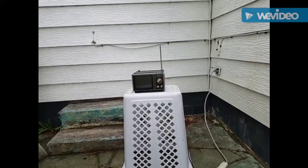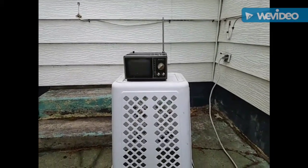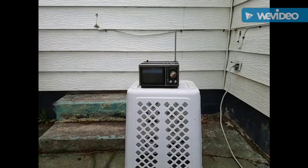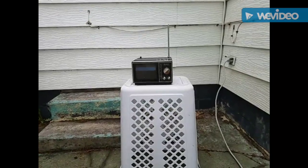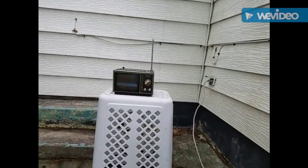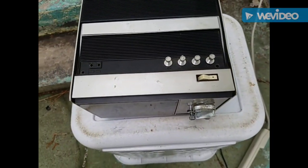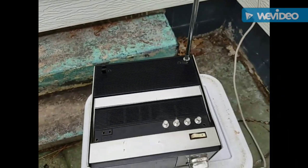It's powered up! Look at that — we got a picture! You guys can see it on the camera, and it's a full picture too, not just a blank line. The brightness is turned all the way down, that's why it's so dark. But that was pretty quick warm-up time — I'm surprised. Let me turn this off before I blow some components with the bad capacitors. Now I feel much safer turning this thing on. We've got contrast up — brightness was all the way up but contrast was all the way down.